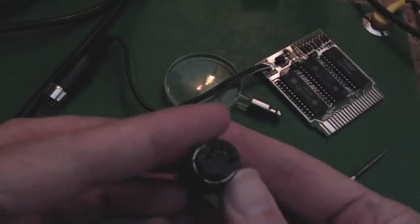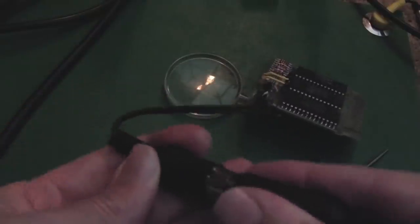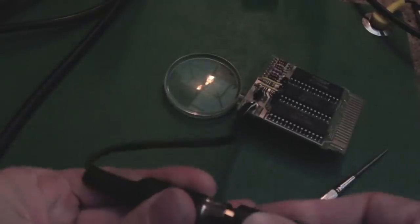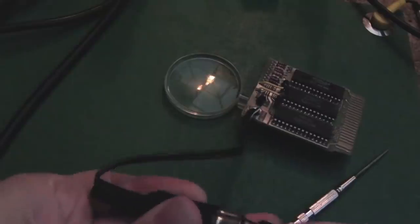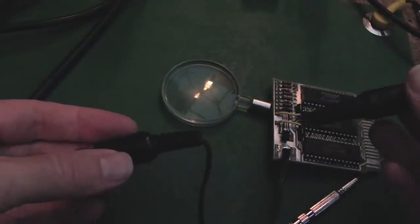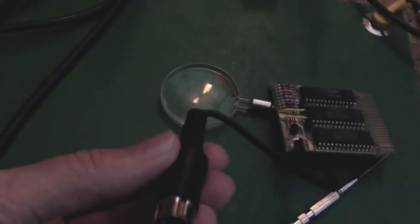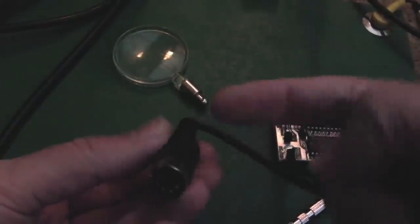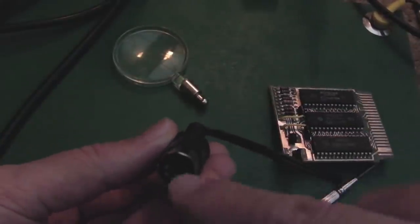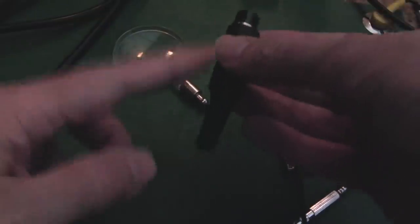What I'm going to do is take a five-pin DIN and its female counterpart and put them in parallel — a short lead with all five connections passing straight through. That means you'll be able to plug this into the video port on the C64. The audio goes into the SID on the input pin, and then video and audio will come out here so I can use my normal AV cable.